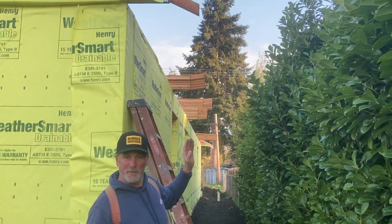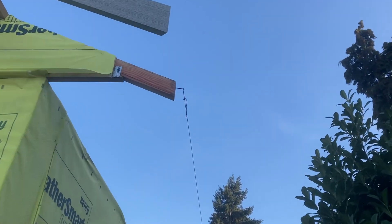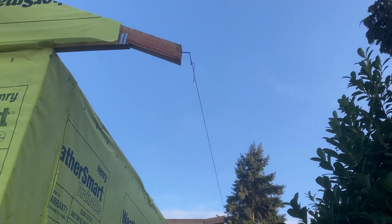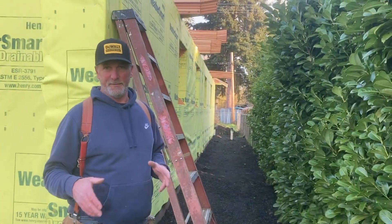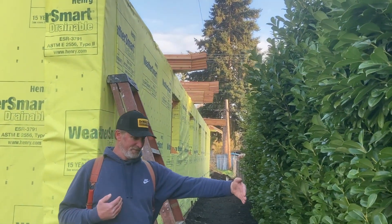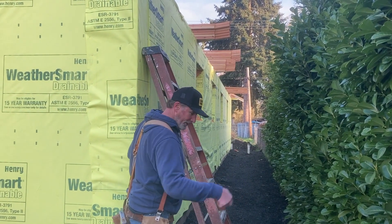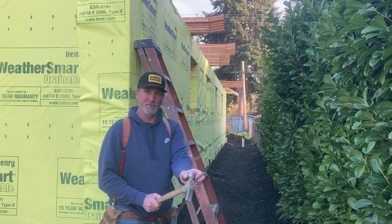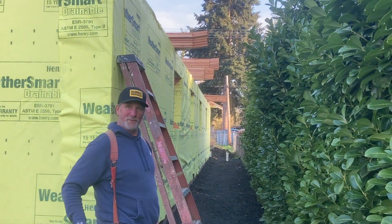I decided to set the back. I ran a string from end to end of the gables, so each tail needs to come out the same amount — an inch and a half away from that string. We had to put the two gables up first to do that. As we roll across, it keeps me from having to mark the wall. Most framing hammers have a head that's an inch and a half wide, and we intentionally set that string up an inch and a half away because we know we have a tool with which to check it.